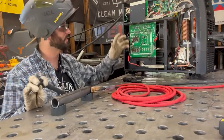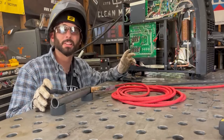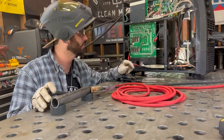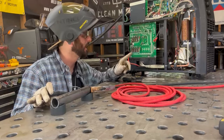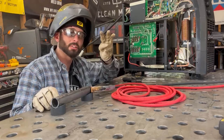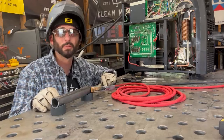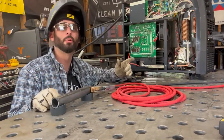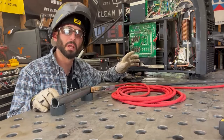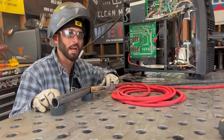We've got it all sorted out now. All we had to do was take off the panel, clean it a little bit, and get the schmutz off of it. There seemed to be something in between the contacts that messed up my spark gap. We got it cleaned up, made sure it's aligned right properly and has the right gap, and our high frequency is now working. Now if that still isn't working, you're liable to need a new high frequency board. Get with your manufacturer's customer support and see what you can do about a new one. If it's an older machine, you might need to get it parted out.